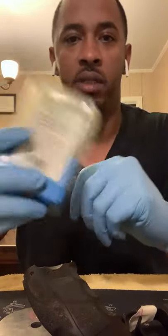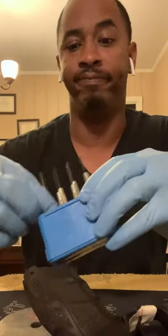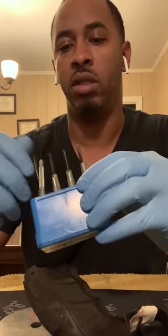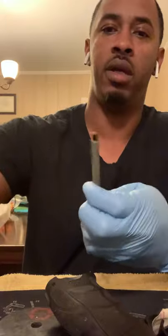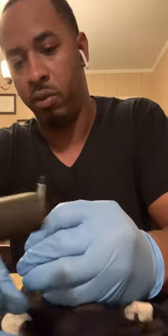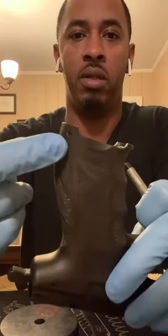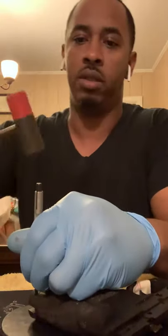Next, it's going to be the back strap. Grab our pin set, I grabbed that up from HK Parts. One of the best punch sets I've owned, fits everything for an HK. And grab our hammer. Start with the rear pin in the back strap. It's going to be that little pin there. Put it on the punch. It ought to move pretty quick. Through.